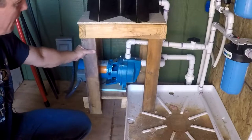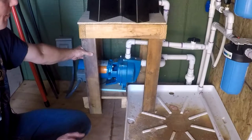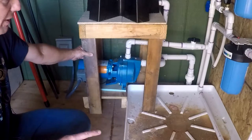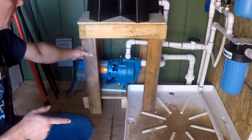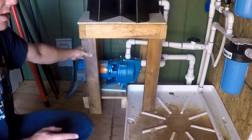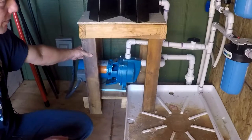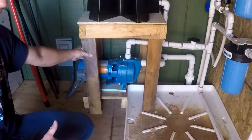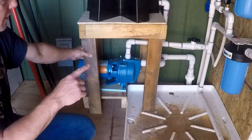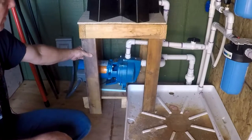This pump doesn't have a backflow check valve, so when it builds pressure and shuts off, the pressure it built goes back into the tank. To fix that, you just install a simple $10 one-way check valve in the pipe — it looks just like a fitting. So when you shut off the water, the valve closes and the system stays pressurized.